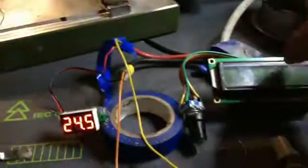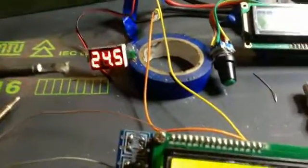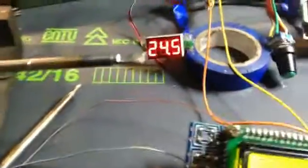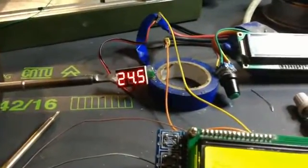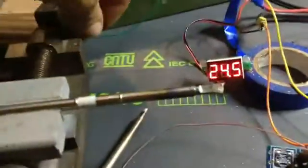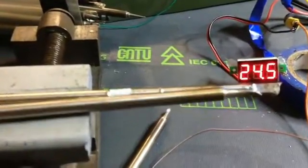It has very nice presets and very fast heating. For a soldering station, you can buy this item — it is all very nice with the T12 handle. I can give confirmation that it works; for the 907 or 906 handle I cannot confirm. With T12 it works very, very nicely. Just remember to connect the vibrating sensor and the sleep switch mode.